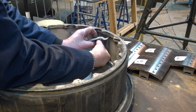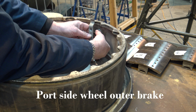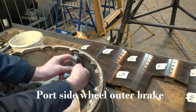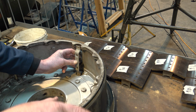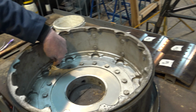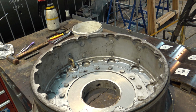I see, yeah. Two push dimples there. So when the pilot releases the brakes, the action of all the springs pull the shoes back in, compress the air, squash the bag, and then the air goes back up the pipeline exactly the same way it came, and then it's exhausted through the brake relay valve.